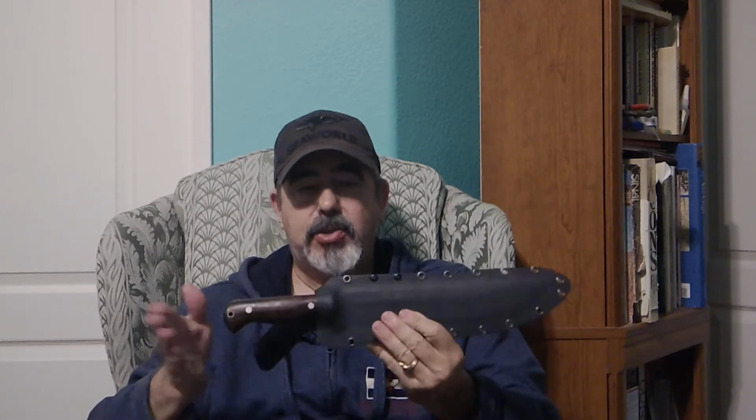So now when it comes to heat treating, like I described in Nepal, they use a water pot to go along there. When you're talking about tool steels, like let's say a D2 tool steel or O1 tool steel or an A2 tool steel, some of those steels are oil quenched. So they're going to take the edge and dip it into a trough of oil, or like you might see in Forged in Fire, where they have that tube filled with oil, and you see them douse it. They put the entire blade, all hot and red in color, and they dip it in there and big flames come out, and that's because that oil ignites from the temperature of that steel.